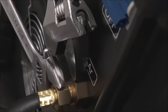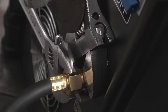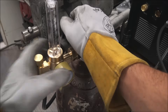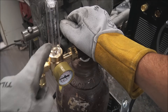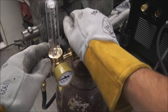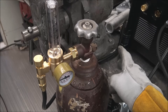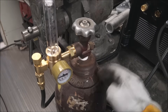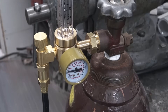Snug it down, making sure you use two wrenches. Hold one on the machine so you're not twisting that fitting. Slowly turn the valve open on the bottle. If you go too fast, you'll slam this ball up to the top. I've done it probably a million times and it hasn't really caused any issues, but the right way to do it is slow. And then make sure your bottle's chained to a wall — it's dangerous. If you knock this over and it breaks, it can become a missile. Check for leaks.